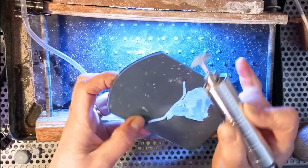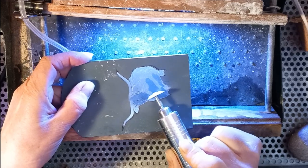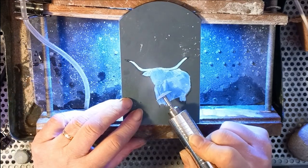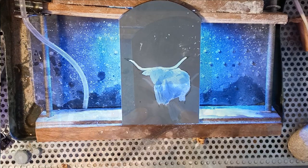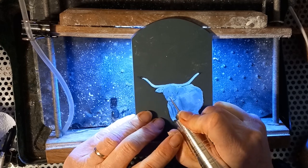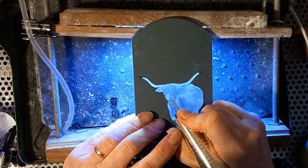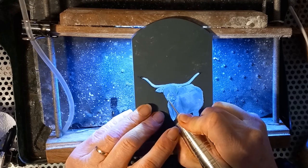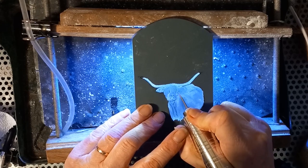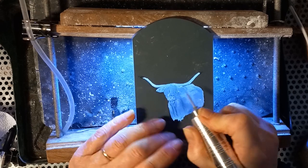You can see how I have to come right up to the edge to get the shade at the front legs here, and the very sharp knife-like edge on the polishing rubber is helping me with that. This is just an initial polish, but by doing that I can start to see where the light and the dark is falling in the engraving and then go back and fill in more detail. So I've got a very fine little ball-shaped diamond in the machine and I'm using that to pick out individual hairs, to put in more highlights, and to make sure I've got the texture I want around the face — little fluffy bits at the side of the face.